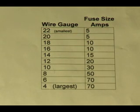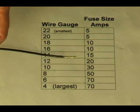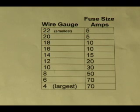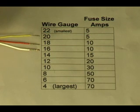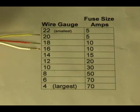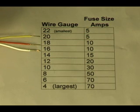On the other side of the coin is a much thinner wire. This is an example of a size 14 — it can draw a lot less current but is quite common and suitable for a lot of our circuits in the aircraft. Here are some other examples of wire sizes: that yellow wire is a size 20, the red is a size 18, and the white is a little bit thicker at a size 16. These are going to be some of the more common standard wire sizes you will use when wiring your aircraft.